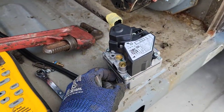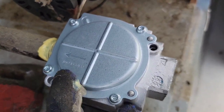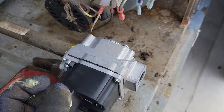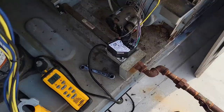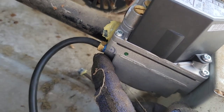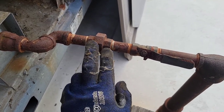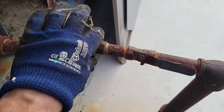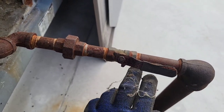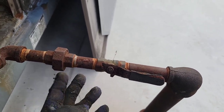There was just barely enough room without having to take the inducer motor off to turn and remove the gas valve. I've got pipe thread sealant on the threads and I'm ready to thread the new gas valve in place. Also important to mention: there is an arrow on the gas valve so you know which direction to install it — that way it actually works when you get it installed. Make sure when tightening the union you have two pipe wrenches so you don't twist these older connections and cause a leak.